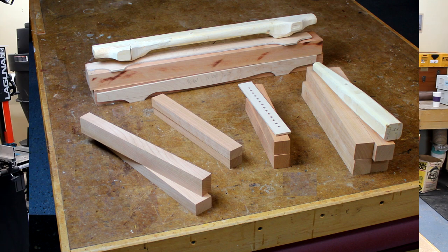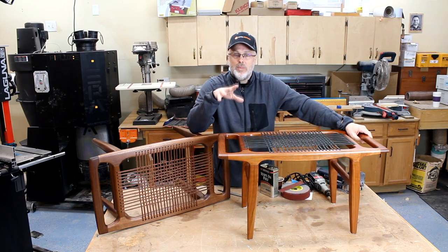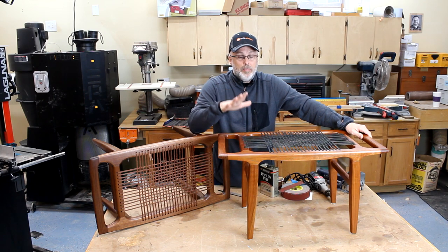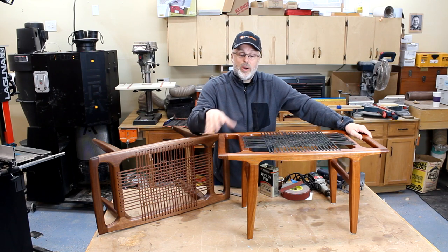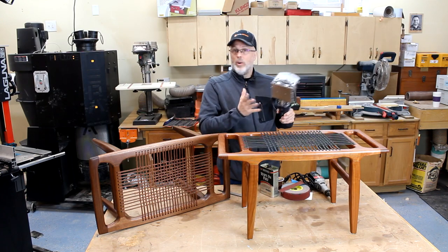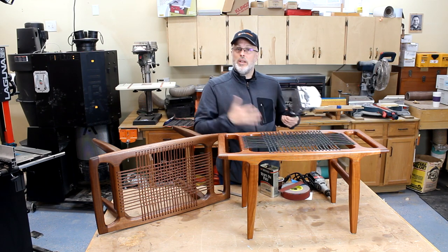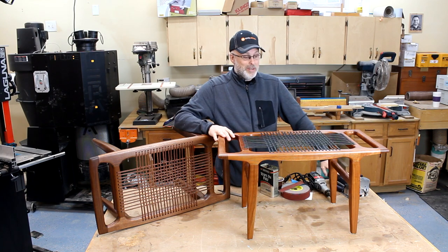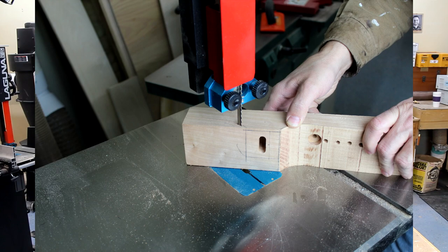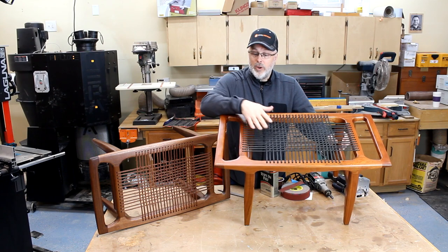I made a set of templates based on designs I was able to abstract from pictures online and dimensions I found online. After cutting them to square, I drew the pattern onto the pieces. I then did all of the mortise work — I used a Domino joiner to do loose tenon joinery throughout this piece and it worked great. This was one of the first projects I did after buying the Domino, and it was just such a great tool for this project — it was almost worth the price of the Domino just for this. Then I used the template to draw out and drill all the holes, which are based on five-eighths inch spacing, consistent throughout on the front, rear, and sides.